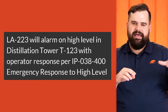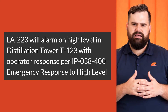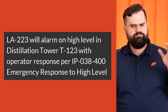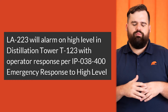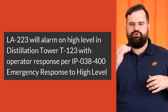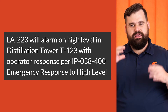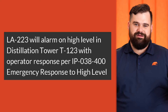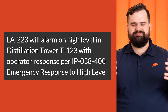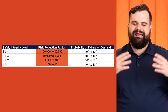We put the alarm tag — it's going to be high level in a vessel — and then we have an operator response. This is a manual response, not an automated response. We even listed what the emergency response plan was and what the operator procedure is. As mentioned in the short form, you really want to make sure you have a documented response, even if it's pretty simple or straightforward. If you don't have a procedure, you want to mention that in the safeguard.